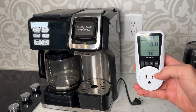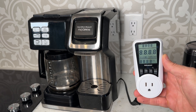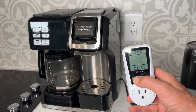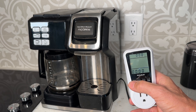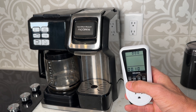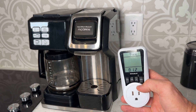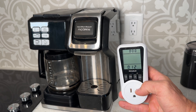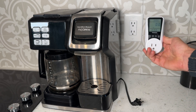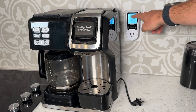Let's run a quick test, but first I'm going to reset this meter. Now this meter can also give you cost — just hold the cost button for three seconds, hit your function key to go through the decimal places, and adjust. I pay 12 cents per kilowatt hour, so I'll set that to 12, press cost again, and now we're locked in. During a multi-hour or multi-day test, having that cost entered is helpful because it gives you the overall cost of energy consumed.